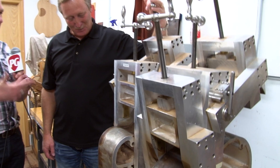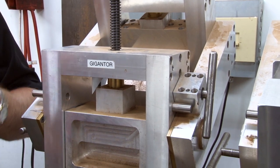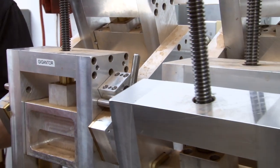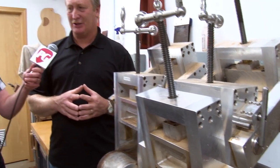We've stepped into another room. You've got this side bender — is this your own design? Yeah, we have a machinist out back. You'll notice as you walk around the shop our fixtures to hold the body, parabolic sanders, and side benders are all aluminum — we built all these ourselves. The reason we chose to do that is our peace of mind for excellence. If we build it ourselves, there's no one to blame. That's why we chose aluminum — wood on wood is going to move a little bit.